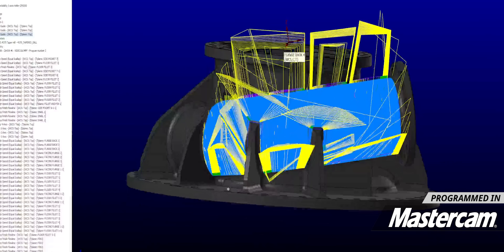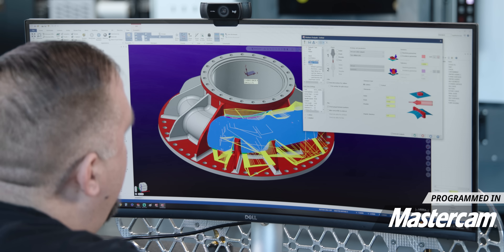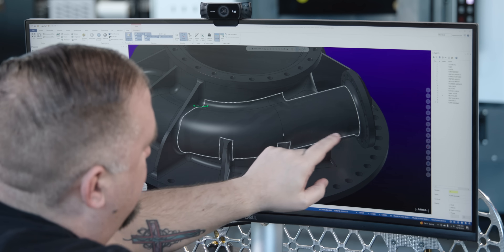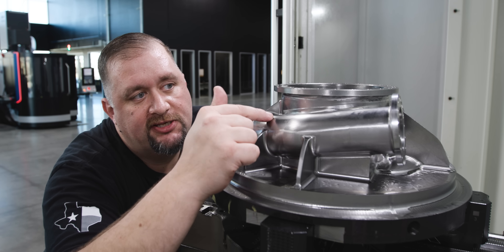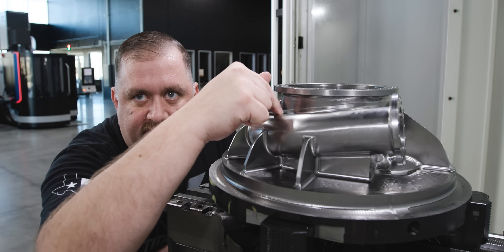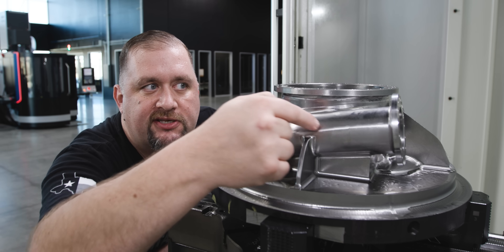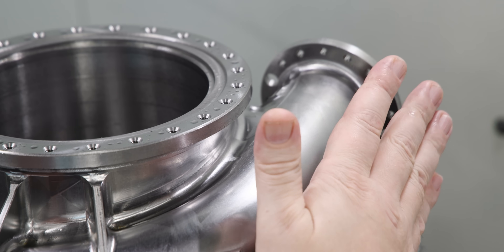You can see that this tool path is capturing almost this entire section of the snail. Within this tool path, we have a guide — it's the outline of all the surfaces that I'm telling my tool path to machine. On a part like this, our tool axis vectors are so important, because if I just tell it to stay perpendicular to this surface, as we come around the top, our tool is going to hit this top flange of the part.